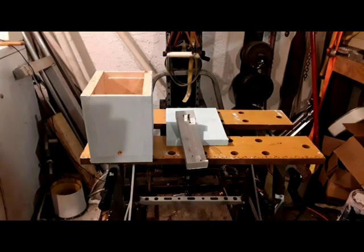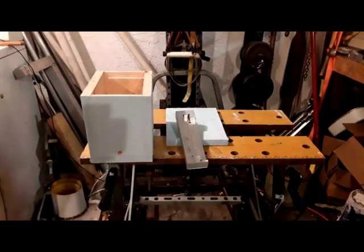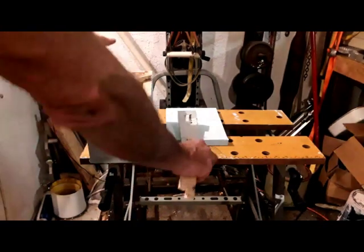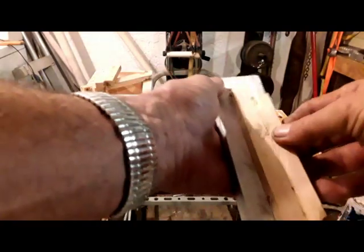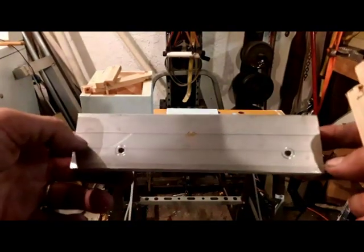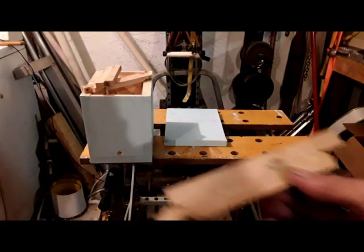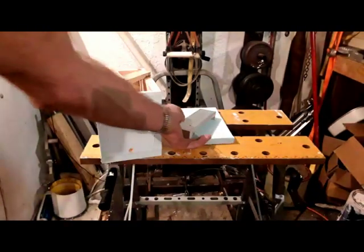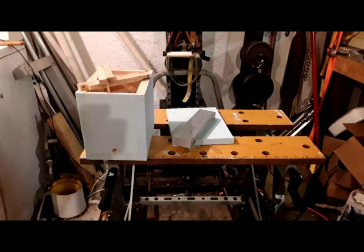And my vertical dowels here, that's just a piece of 3/16 rod, and it's in the jig. So when I've got the jig set up and I've got the piece in the jig, got 2 holes right there, 3/16 inch holes. I drill them through. That gives me the 2 holes in this thing to put a dowel. I don't know if you need it. I don't want the bees to draw a comb and attach it to the wall of the box, so I put the dowels in there to try to keep that from happening.